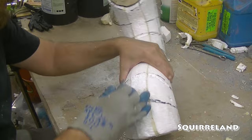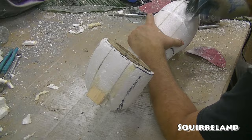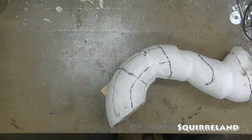The sandpaper that I use is a combination of an angle grinder disc and a folded over 80 grit piece of sandpaper that I use on my orbital sander. The angle grinder disc is very coarse and can remove material very quickly. The sandpaper then can smooth everything out for a more refined finish.